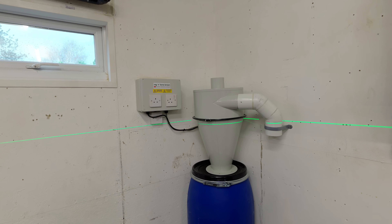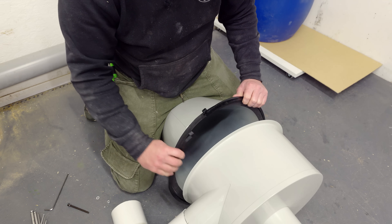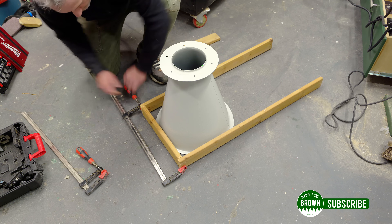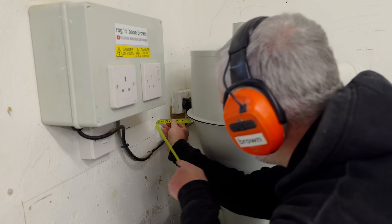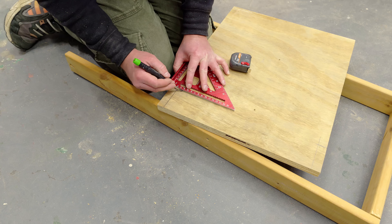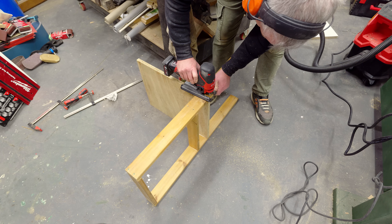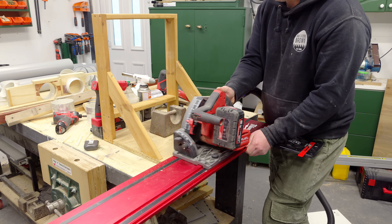I set a laser level to the height of the rim around the middle of the cyclone, mark that up onto the wall, and take the cyclone apart. The cyclone has a rubber gasket between the two parts which is good for keeping it airtight. Using some old salvaged bed slats I'm going to make a simple bracket to wrap around and support the bottom part of the cyclone. I also need to measure the distance the cyclone is to be placed from the wall. I found a scrap of 18 millimetre plywood and I'll cut some notches out so that I can fit it in between the two rails, and then add a couple of diagonal support pieces and trim away the excess.